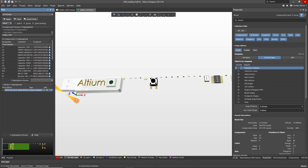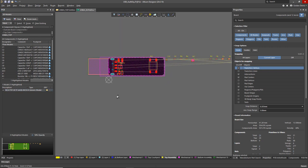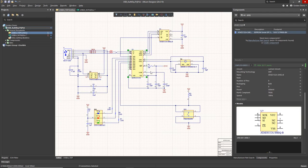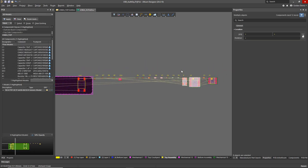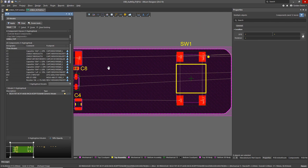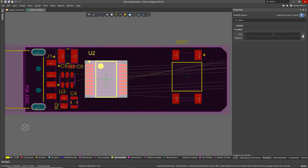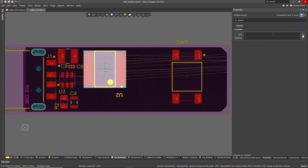Just to go back here, I can show you that 3D model — the enclosure obviously is pre-done with a hole for the push button to go through, and I could eyeball the placement. But later on we're going to place that using a precise technique using a file that has some XY data in it. One of the cool things I really love about placing parts in Altium Designer is you can select them in sequence on the schematic, and then on the PCB side those same parts are selected. There's this really cool tool that remembers the sequence I used in the schematic to select them.